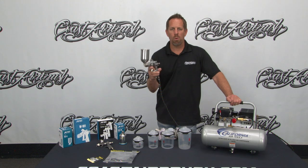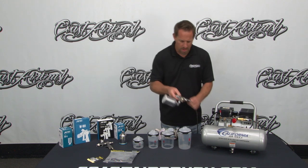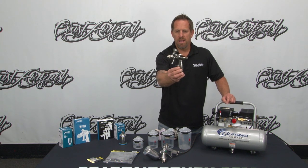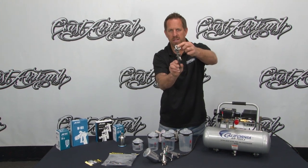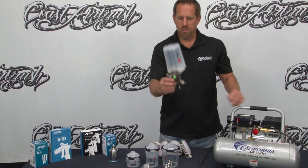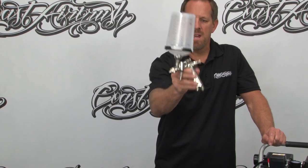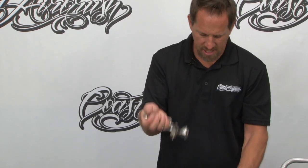It's used very often in the art world to create extremely good fades, so some of you that already have this gun — it's a great choice. Now, another great choice, slightly smaller, is the LPH-80 from Iwata. This is a typical gravity-fed version. I'm going to demonstrate with the quick-disconnect adapter that we can use different size PPS cups. If you're looking for larger volume without having to reload, you can choose between the variety of sizes of the PPS 2.0 system cups. This provides a lot more volume of material, and then you can tip it upside down, disconnect it, and you're good to go.